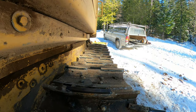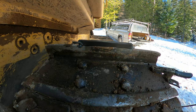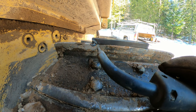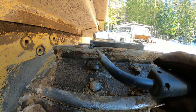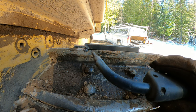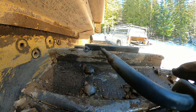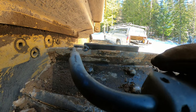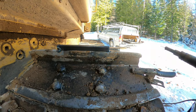It's starting to look pretty good. We gotta get this track tightened — it'll hump like a snow hill in the middle. There's a broken cleat there. Here's the gist of it: I'm hammering the groove, doing a push — pretty much hammering the groove, coming up, doing a little puddle work, kind of a J. Hammering that so I can get into this, get a little preheat action going, and then just tapping into the cleat — the new cleat. It should work. Then push, J it, and out the other side.